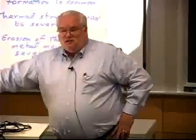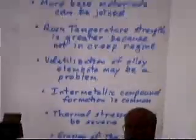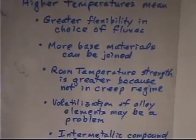You basically bend the metal, the copper or the steel sheet like this, and that's supporting the strength. And you get the sealing power from the solder. So you get your hermeticity, you keep the moisture out and the air out with the solder, but you get your mechanical strength by screws or lock joints or things like that. So there's plenty of ways to design it, but in general, it's best not to design a solder joint to be the structural component. Now, if we go to brazing, brazing is the same as soldering except higher temperatures, and that means a number of things.